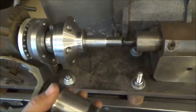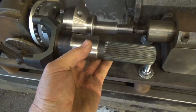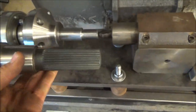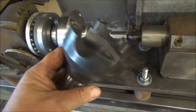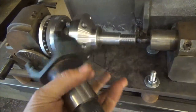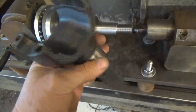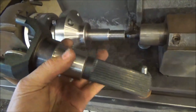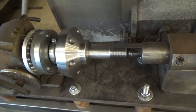So you can see the difference here between the GT40 axle and the one out of my independent rear end. So mine are considerably bigger. There's bigger spline count, bigger bearings, everything in them. Mine take a universal joint instead of a CV joint. And mine, well, they take thousands of pounds of torque, where these are not taking a quarter of what I can throw out mine.